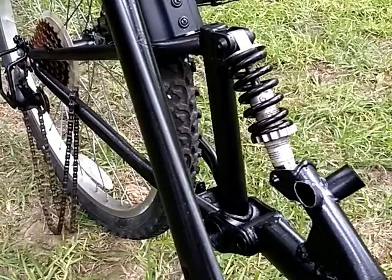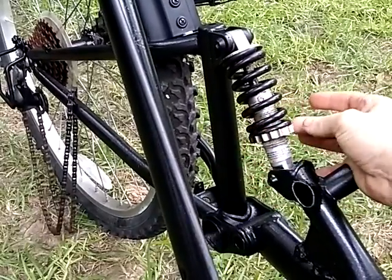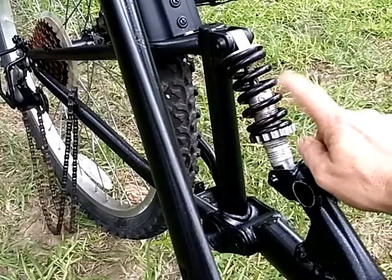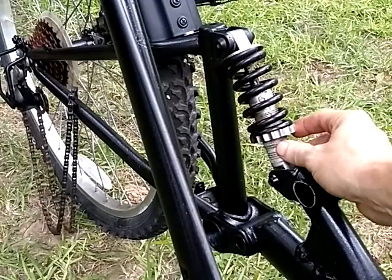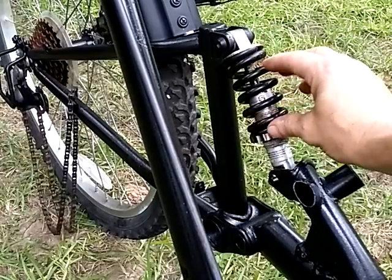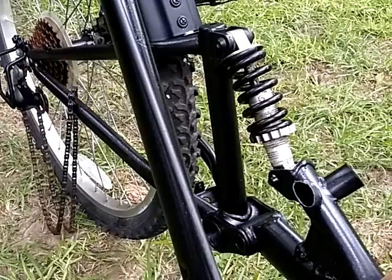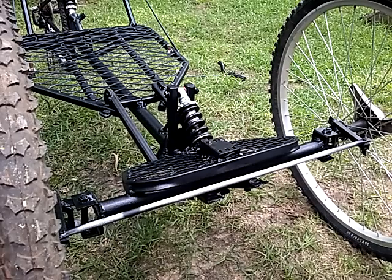It's a very easy problem to resolve. You adjust this shock by turning this nut right here, and that lengthens and shortens it. These springs hold somewhere in the neighborhood of 800 pounds, and this is adjusted almost completely to the softest setting. I could just screw this up and compress that, and that would stiffen it back. I had to actually jump up and down on it to compress that suspension on its lowest setting. As you could see, as soon as I stepped on it, it tried to roll away with me — so it rolls very, very nice.